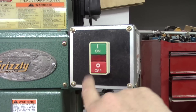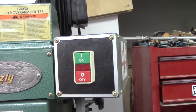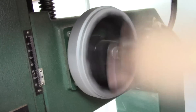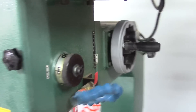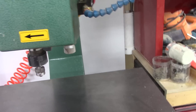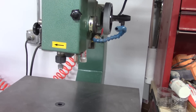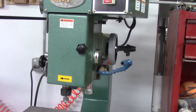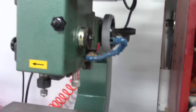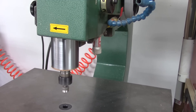The locking or off-button lock system is not on the Grizzly. I want to make sure I raise up the head before I turn it on — I don't know how deep this is going to go or who used it last, and what I'd hate is for it to come crashing into the table. It's a little louder than the Jet, and that's because it works at 20,000 RPM versus 10,000 for the Jet. It's got the same foot switch.